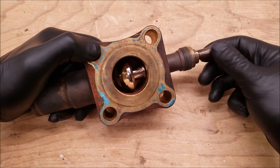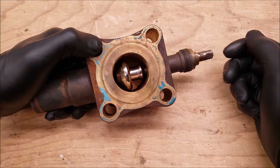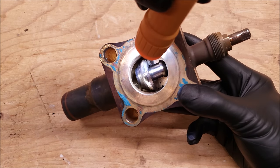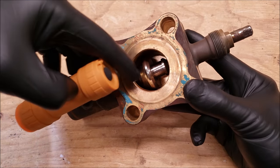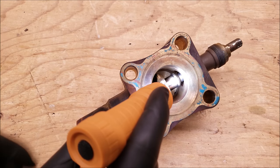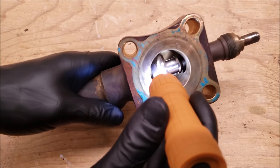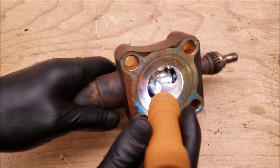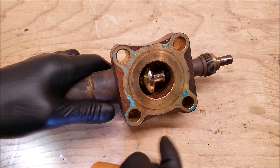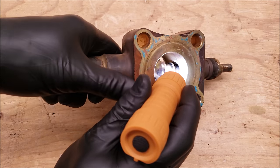The next position is still the mid-seat position, but it's halfway down. The reason for this is so that you have a large opening here to connect this tube, and also a large opening in here. By having these large openings available, you're going to be able to recover the full amount of refrigerant from the system without any restrictions heading over to this port. Also, if this system was empty and you're trying to vacuum it, there's not going to be any restrictions as well.